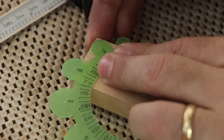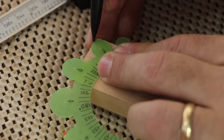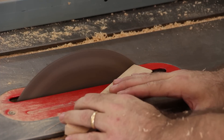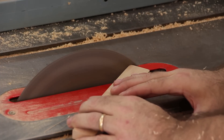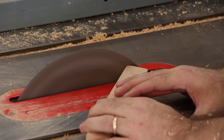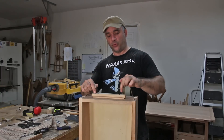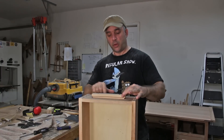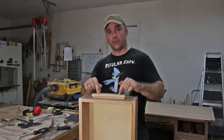I'm going to trace a quarter inch radius at the corners and then remove this material with the sander. I pre-drilled my drawer pulls into the square plug holes we created on each end. Now with a little bit of glue underneath the drawer pull, we'll screw it down.